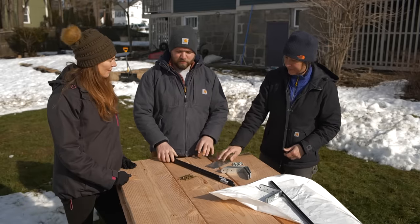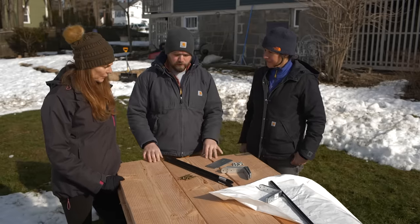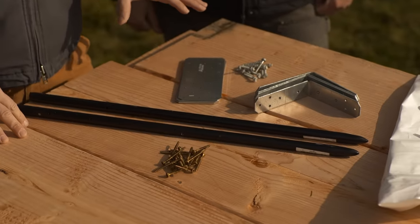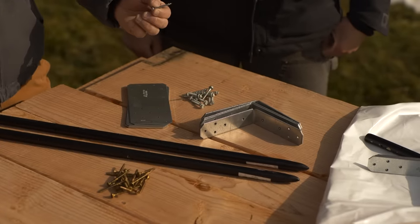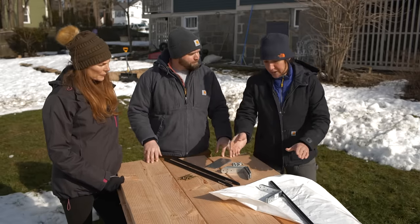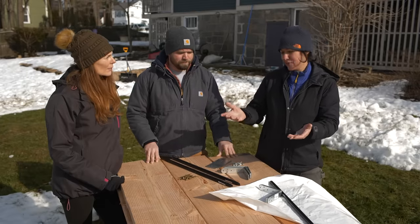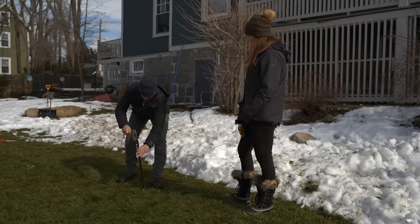So these are the key components that we need to put together the skating rink. We have some 2x12 stock, which is nice because it's really tall and gives us some flexibility to level out the ice. We're going to secure it to the ground with these concrete stakes — or form stakes. These are really cool because they have holes up and down the sides, which will help for leveling everything out. We'll secure that with some 2-inch screws. For the joints, we have these mending plates for the flat seams and then these nice corner brackets to secure the outside. We're going to secure those with some 1.5-inch galvanized screws — you can use these a bunch of times, pull them in and out, reuse them every year. And then here we have this special 7-mil thick plastic. It's going to form the base and be able to hold the weight of the ice. Another important thing is it's white, so it's going to reflect the sun — if it was black, it'd absorb it and cause melt. This is going to be a key part to your rink. The next step is figuring out the layout.